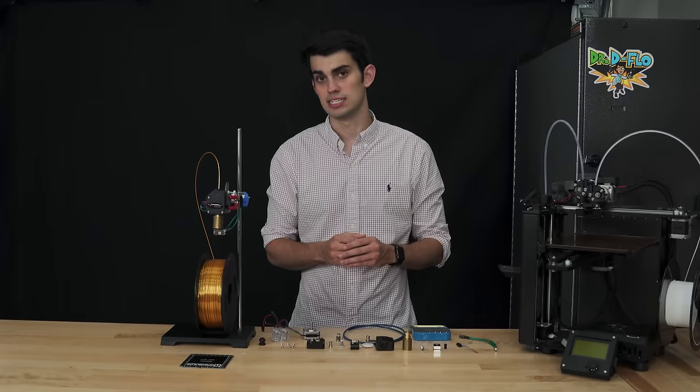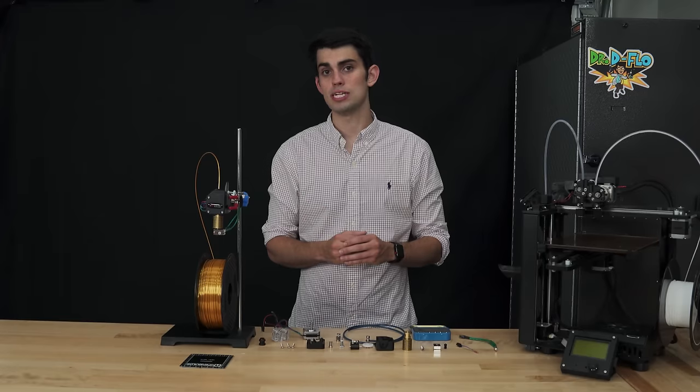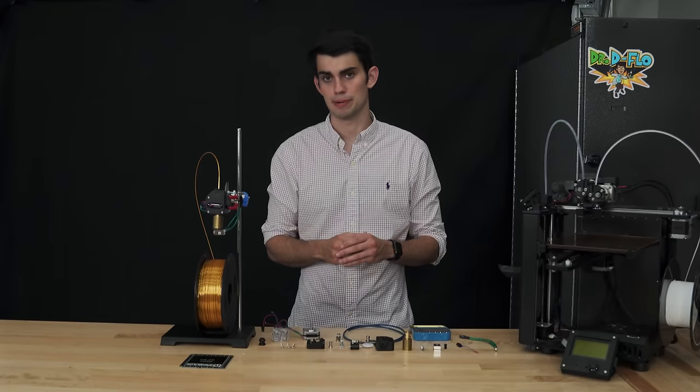For the direct extrusion system, the pros and cons are swapped. You can't accelerate and decelerate as quickly because the carriage has the added mass of the stepper motor, but the extrusion and retraction of the filament is more responsive. I tend to always employ direct extrusion as the maintenance is minimal. Further, I tend to print at lower speeds anyways because part quality is always my highest priority.